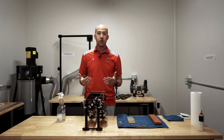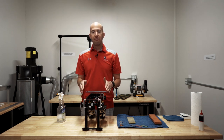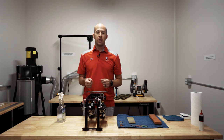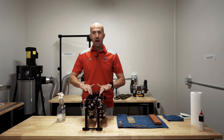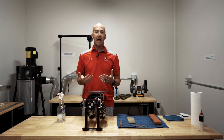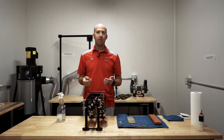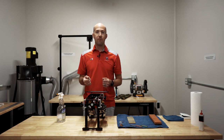What we're looking to do when we're sharpening is create a burr. The burr is the metal that's going to get folded over and roll off the blade as we're grinding it down. The burr is really the most important thing that we want to monitor while we're sharpening. The goal of sharpening is to create a consistent burr on all four edges from the very back to the very front. That's how we know we've removed material at an even pace and that's what you should be looking for. Everyone has a slightly different process for sharpening and I encourage you to create your own process over time.